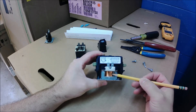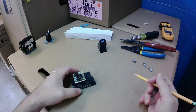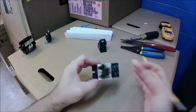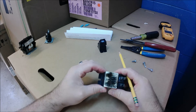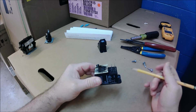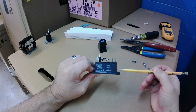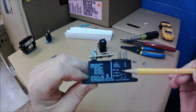What I wanted to show you is I've been getting questions on DC-style heat sequencers or heat relays. Here's one — you can see all the pretty black stuff. Somebody has smoked this thing, literally. This came out of a Carrier family unit — I think it was actually a Bryant — but this is a DC relay. If you look at the side it'll tell you, it's a DC coil that operates this relay.